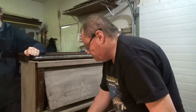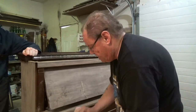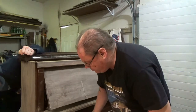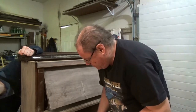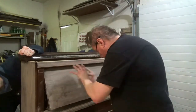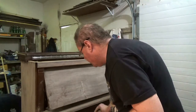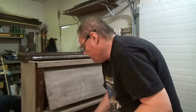We're doing it by hand because it's less likely to mess things up. With a random orbital sander, when you touch it to the wood, there's a bit of a trick to placing it against the finish — kind of go into it so that it doesn't leave a big swirl mark, because oddly enough, those are the things that show up.